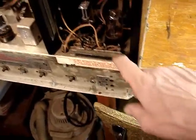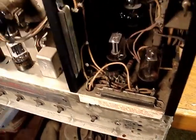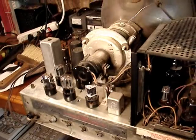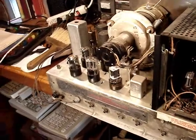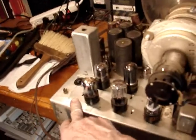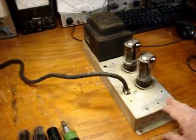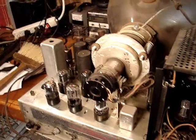I haven't done much other checking. These look like canned ohm resistors, but they really aren't — there's some other kind of resistor. I'm going to have to check those resistors and see if they're open or not. But I have a real problem here: I cannot find a SAMS folder for this very chassis. The one that I got is close, but it has the power transformer and one 5U4 rectifier mounted on the chassis instead of cabled up, because it's a table model television. And the tube complement is slightly different.